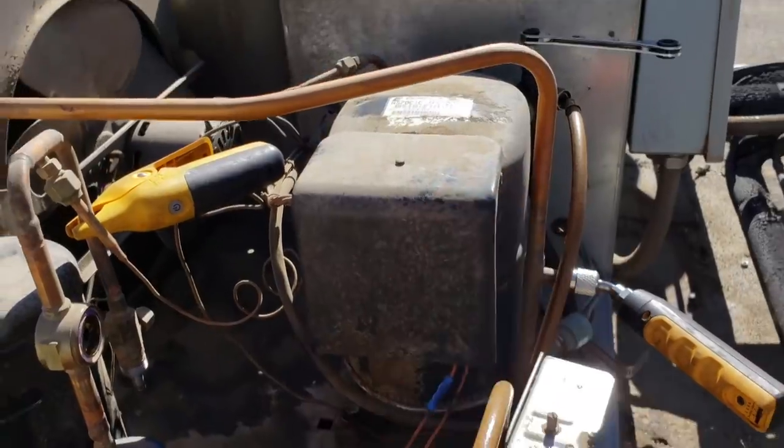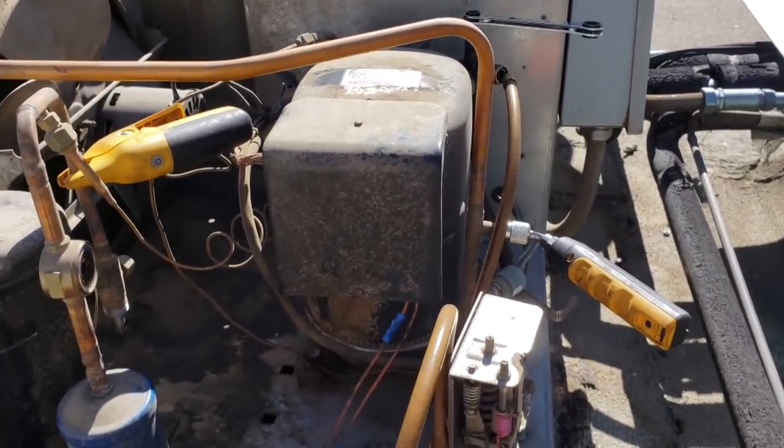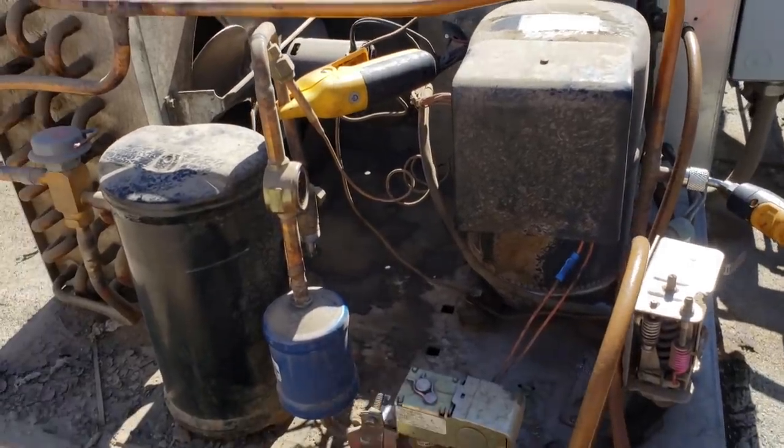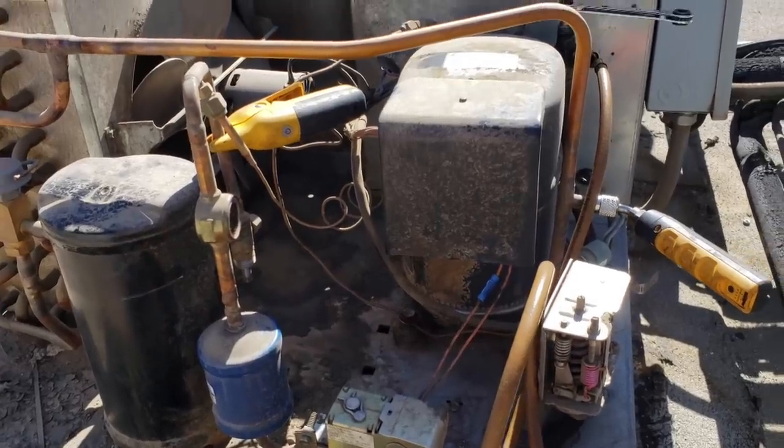While I'm testing that, I'm noticing we've got a weak valve on the compressor. Also, it won't pump down past 7 psi - it just sits there and runs and runs and doesn't go any lower. So that just adds to the mess. This unit has a refrigerant leak, it's got a compressor going bad, it needs a new receiver, and the coil's starting to deteriorate. The customer already knows they want to upgrade this equipment. This was a service call on a beer walk-in that was iced up. I found the unit had a very dirty evaporator coil and was also low on refrigerant. The compressor has a weak suction valve, it was an R22 system with multiple leaks, and the evaporator coil was starting to deteriorate. I went to the customer with a big picture diagnosis and they decided to go ahead and replace the equipment. They've already ordered it and once it arrives we'll go out and install it.